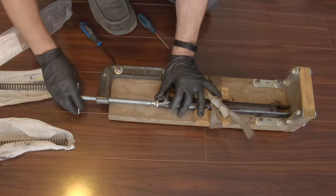Put the stock back on. You have that big screw, thicker head. Tighten that down. Always remember to torque it, whatever the torque spec is. Click, there we go, torqued. And I like to use blue Loctite on these, just so they don't wiggle loose over time. Everything should actually be Loctited.